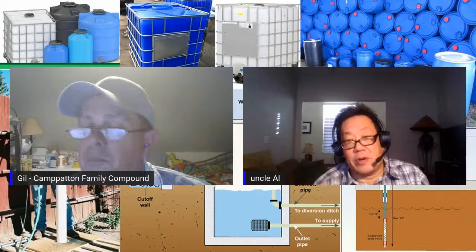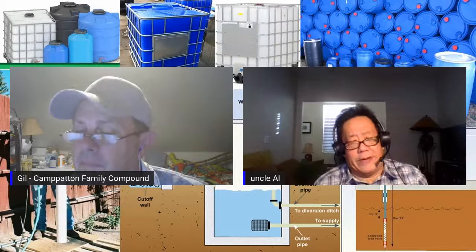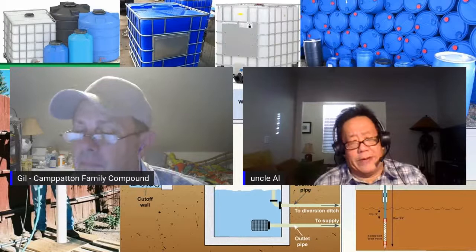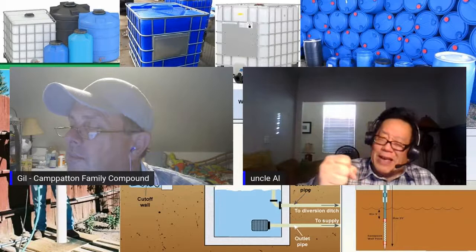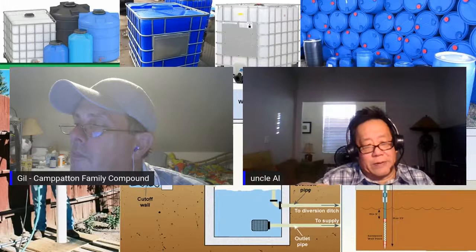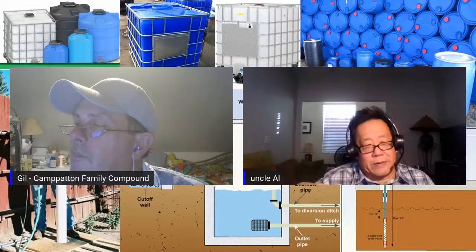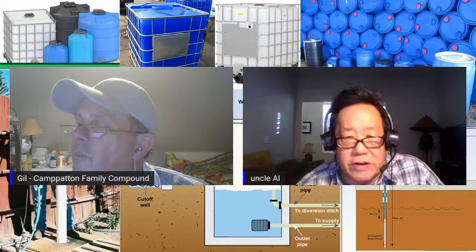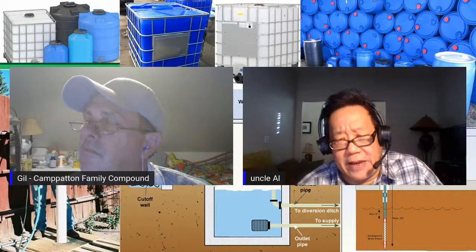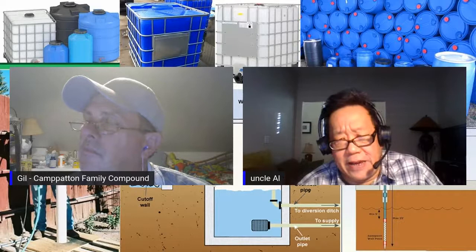You have to be careful where you're drilling. In my area I have trouble — I have a dairy, a graveyard, and a cemetery nearby. You don't want a shallow well near a graveyard — they bury people with cyanide-containing embalming chemicals. On the other side are dairies, which means nitrates from livestock going into the water. And there's a sewer line that goes across an industrial area. Always, once you get your well dug, test the water.